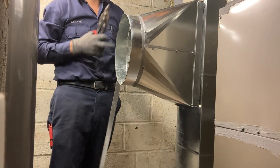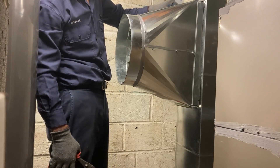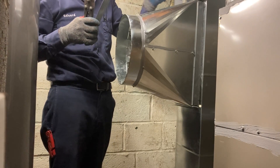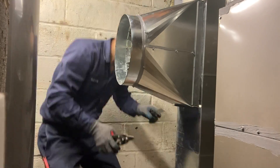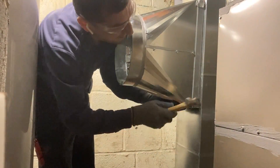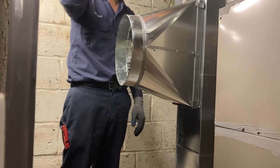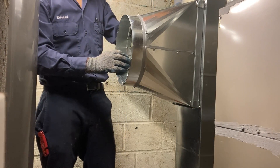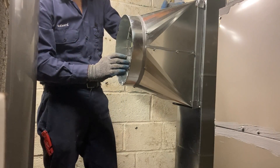Now it's time to cut the drives for this. With the drives, you can buy them standard already prepared, or you can cut your preferred length. Usually I'm making one inch extra on each side. Once we connect everything, we will seal that. I'm not sealing it now because I'm going to work around it and it will get messy. Usually doing the mastic is the last thing before you go home and it will dry during the night. Thanks for watching.